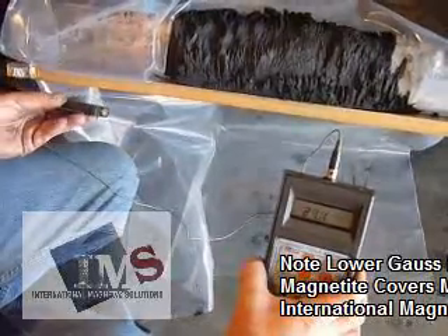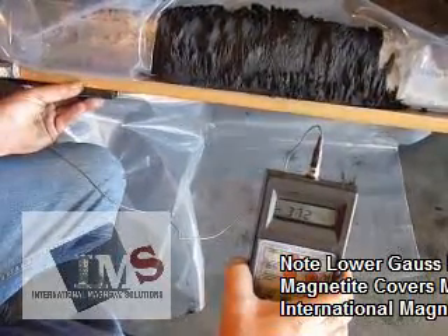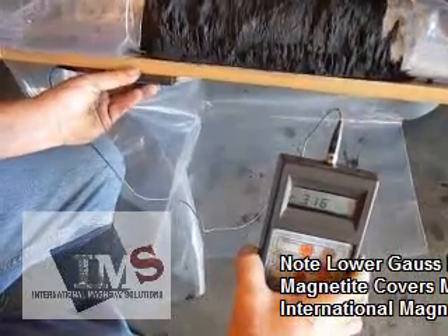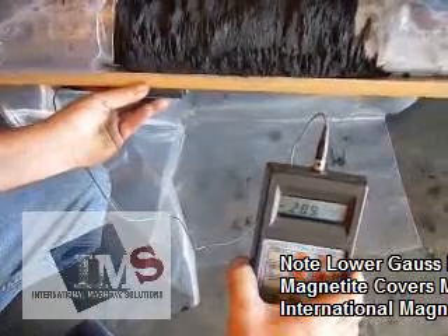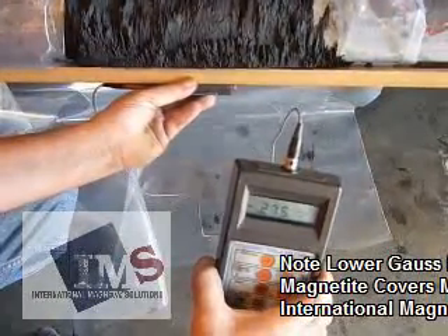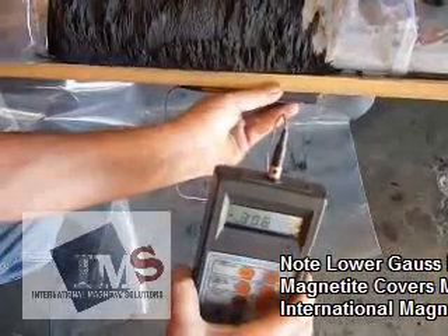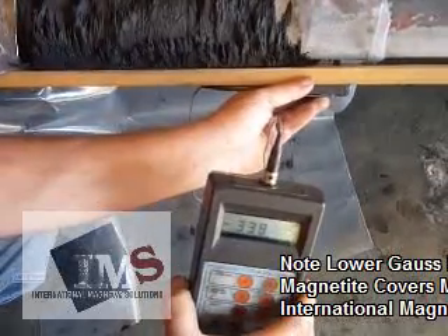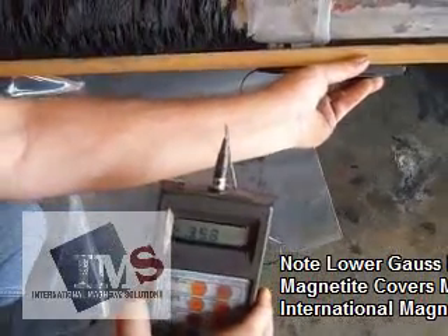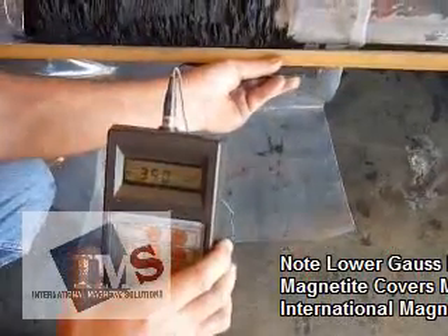There is a section of magnetite over the magnets. We will measure the magnetic field coming from the magnets — it's about 370 gauss. It will drop down when it goes over the area covered and short-circuited by the magnetite. It's now down to 282, then 270. As we go past that area, the system recovers back to 330-odd gauss, which shows that the magnetite does influence the amount of magnetic field coming from the system.